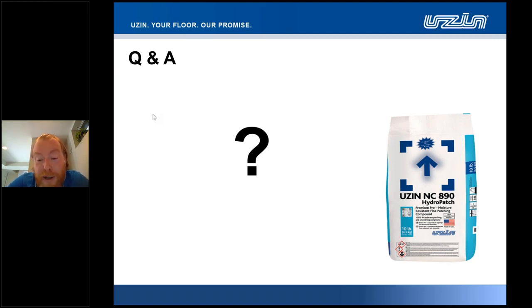If the finish floor covering in the majority still states 85% RH, that's really going to be your driver and your indication that a moisture tolerant patching compound on a floor that's blowing some 98, 99% RH must receive topical mitigation or some sort of a loose lay mitigating barrier beneath that covering, up to 100% RH, in order to tolerate the finished floor covering manufacturer's material placed on the top.